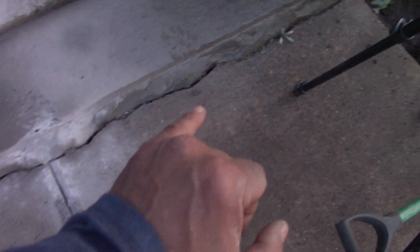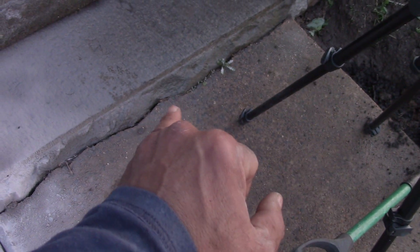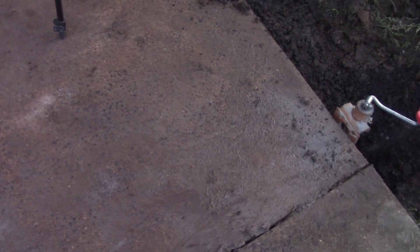It goes over to a stone step. I created this elevation on one corner by continuing the saw cut down the middle. When jacking it up, make sure you're aware it's going to tilt — so make sure that's not going to create a tension point in the concrete and cause cracks. If need be, you can cut a relief cut decoratively. You can even cut this in half, lift the whole piece out, do a mortar bed, and lay it back down on top.